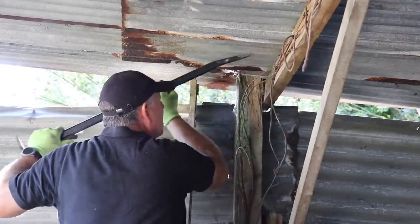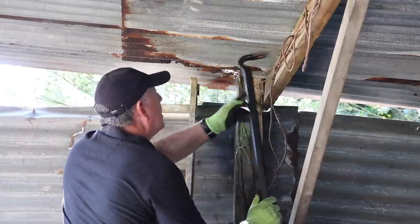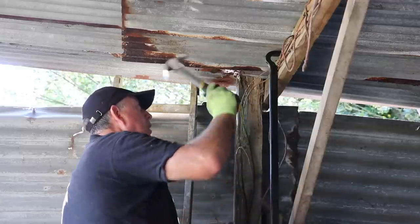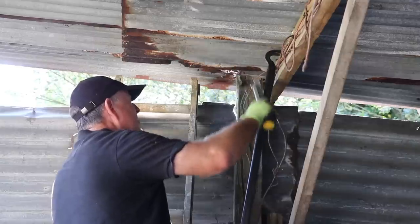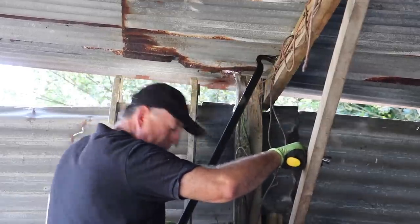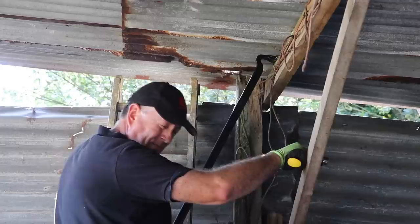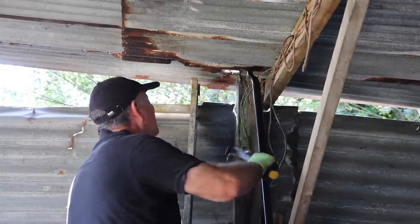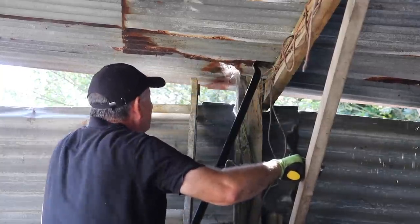Where I started on the end of the roof quickly turned out to be the easy bit, as with another lower roof beside me I have to attack the sheets in the middle from underneath. I have no choice — I can't do it from the other side of this wall. Every time you damage a sheet in, a plume of dust and rubbish falls through, making the whole process very unpleasant. But I know once I get one or two sheets off, I can get above the roof again and carry on with my original technique, which is a lot quicker and far less dirty.